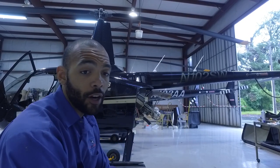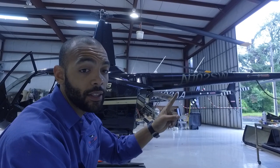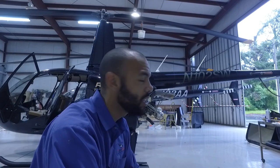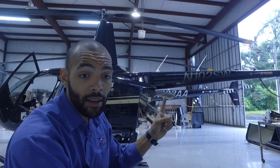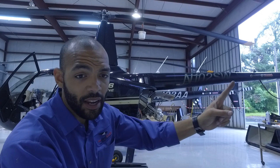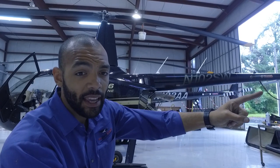Something to note is that since the turbine exhaust is right there just underneath the tail, and since the exhaust is coming out of that aft cowl, that aft fairing is going to be very smutty — almost like the nacelles around a King Air. It's going to be very smutty all the way down the sides of the tail, and it actually makes your candy cane dirty tail rotor blade guard as well.